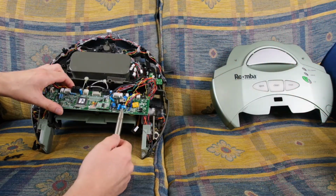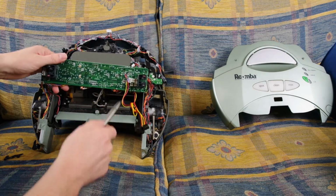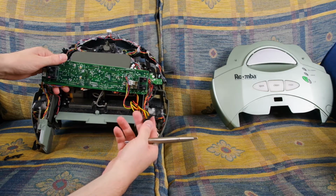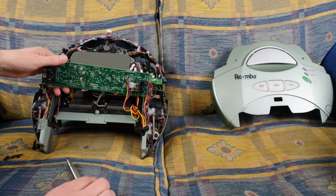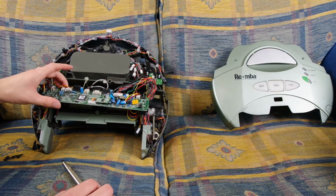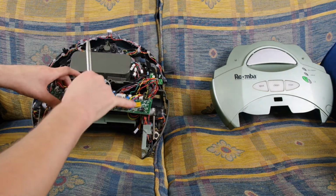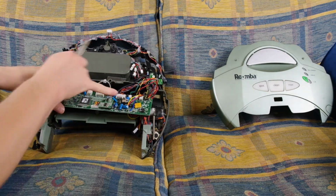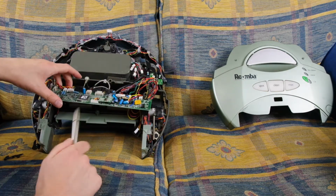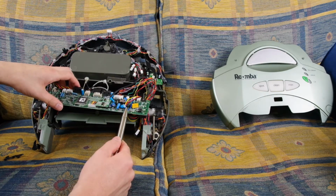Basically what I was going to do is desolder the MOSFETs from U2 and U4, add in these fan extension cables, and then I will be able to plug in the replacement MOSFETs, 220s, I think. That was the idea. The MOSFET U4 is surrounded by stuff, very hard to get out. If it was this guy here, I'd just clip the legs and then solder straight onto the legs. But no. That was a pain in my butt to get out.